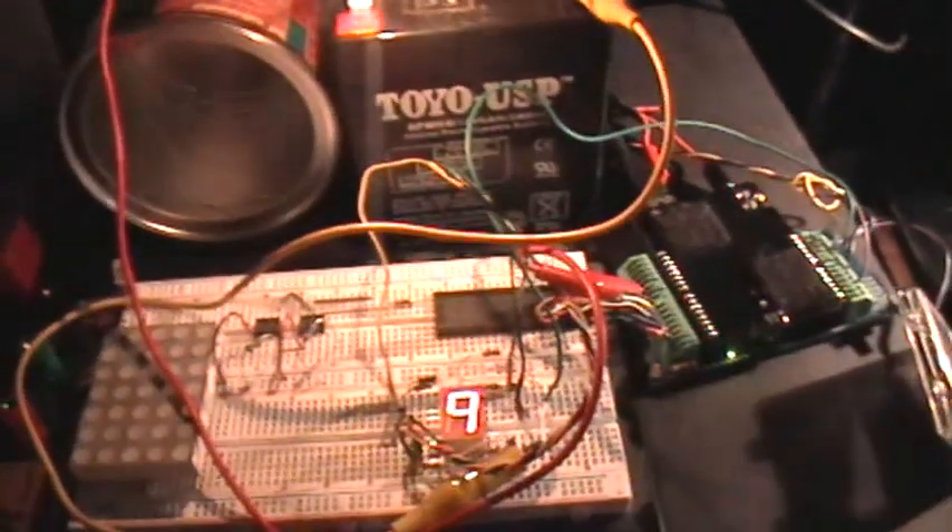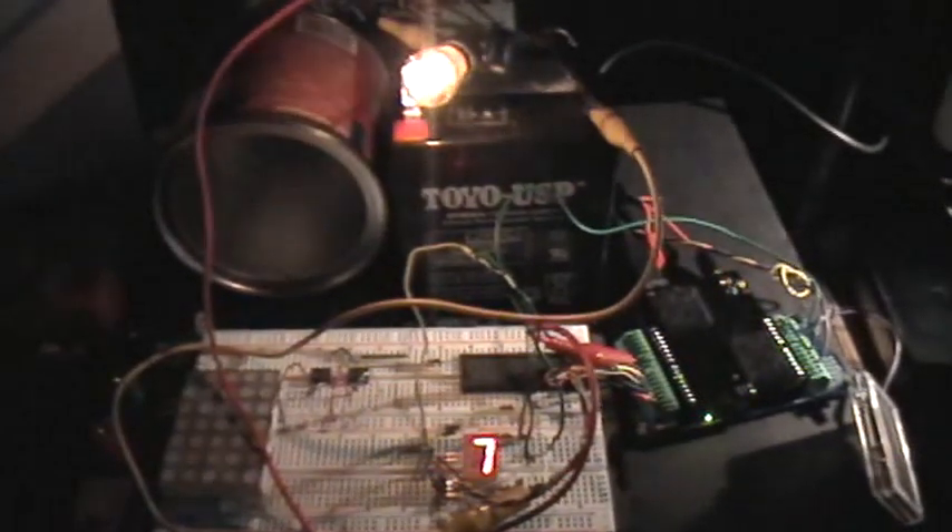So now, using my desk lamp and my hand, I think you can see that — going through the full range of brightness and dimming — we're dimming that bulb with full control, using the voltage input from an external sensor, in this case a photovoltaic.